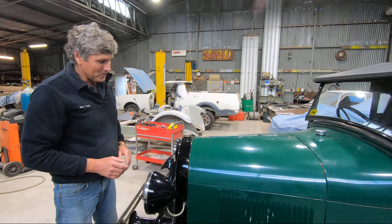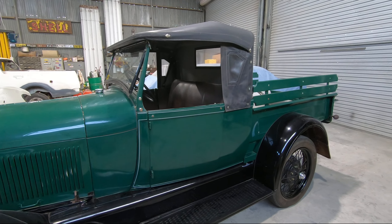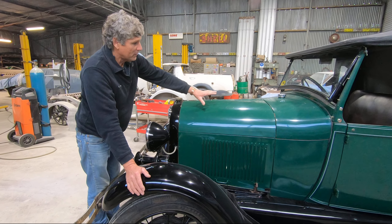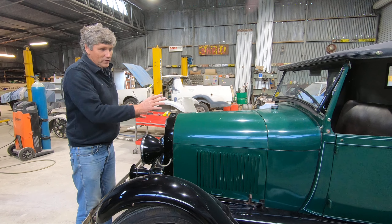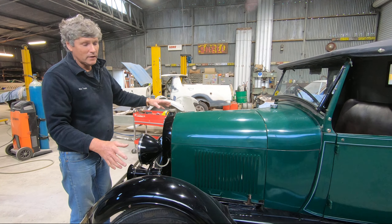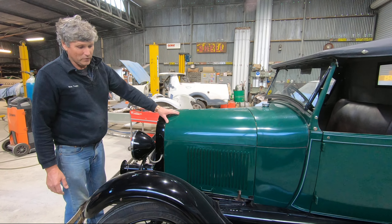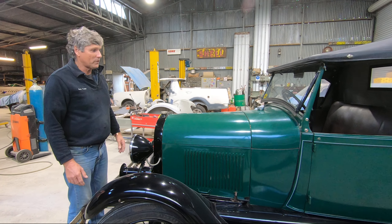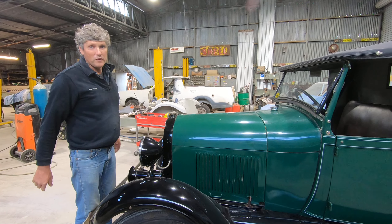The paint on this car is nearly 30 years old, and I painted it along the lines that Ford did originally — the black was enamel paint and the colour was lacquer. So the black is painted in two-pack and the green is painted in acrylic lacquer. The other thing with commercials is that the paint was left just as it came off the gun — not sanded, polished, buffed or rubbed out as the term was in those days. So all the paint on this car is as it came off the gun, never polished, never buffed, only ever washed with soapy water. And really, I can't see much difference in the quality of the two-pack versus the acrylic given the time it's been on there. If we got out there today and gave it even a polish, the paint would come up a hundred times better than it is now.